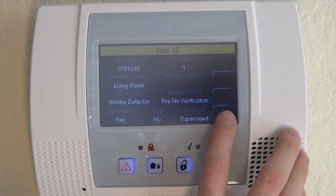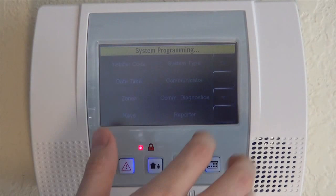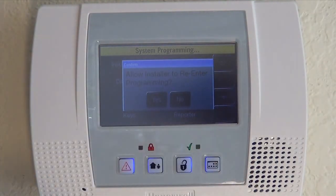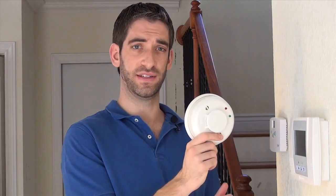You typically get about 200-foot range from the panel with this sensor. Now that we have all this in, click save. You can see that living room smoke detector has now been programmed as zone number 12. Back out of programming — on this screen it's going to ask if you want to allow re-entry into programming mode. Very important that you say yes, otherwise you won't be able to get back in without using the backdoor programming method. Click yes, and we're back to the previous screen. One more back out to the home screen and we're now ready to install our 5808W3 wireless smoke detector. If you have any questions on how to program yours in, please give us a call or email us at support@alarmgrid.com.